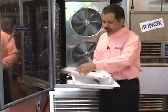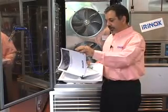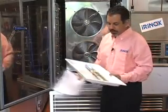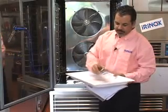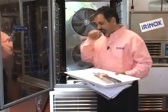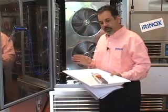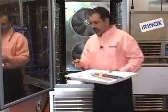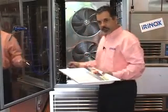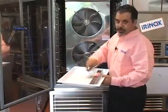Okay, inside the drip pan, as I told you, you'll find your operations manual, which gives you instructions on how to operate the unit, instructions on how to mount the drain pan, etc. You also will have some wiring diagrams that are good for your service company. There's two brackets that are together, and the nuts and bolts to mount the brackets to the bottom of the unit so you can have the drain pan. Now, in case your unit is being mounted directly with a floor drain, you won't need to use this, but you should verify that and install this if you need to. This is a 10mm wrench. The only thing you need to make sure you have before you start is a 10mm wrench. You'll need to install two nuts, two bolts with washers on one side and on the other side through the holes that were provided. And the instructions are in your manual.